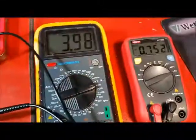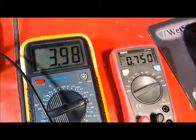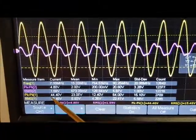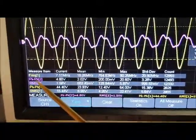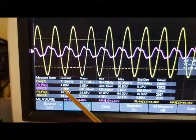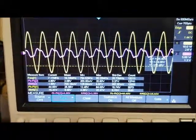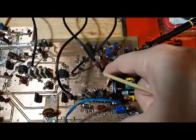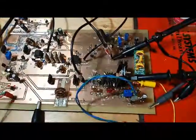At 40 dB of attenuation, it's drawing approximately 750 milliamps. The DC gate voltage has not changed. The output I'm seeing is 44 volts peak to peak into the 50 ohm dummy load, which is very close to 5 watts. I'm seeing approximately 4.8 volts peak to peak at the gate of the IRF 510. It looks as if I'm almost at 5 watts.